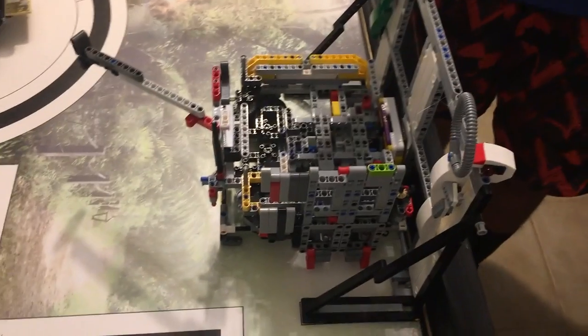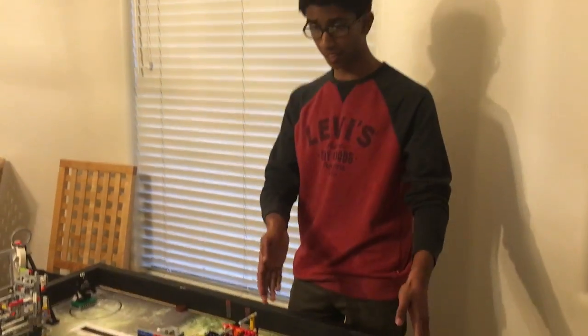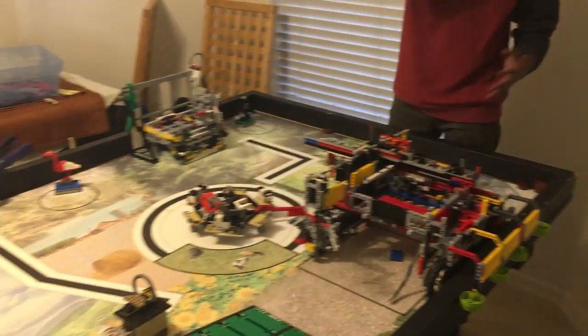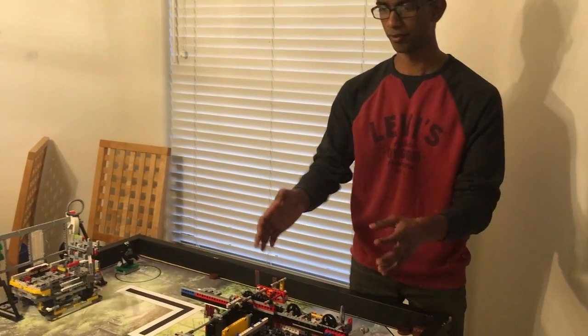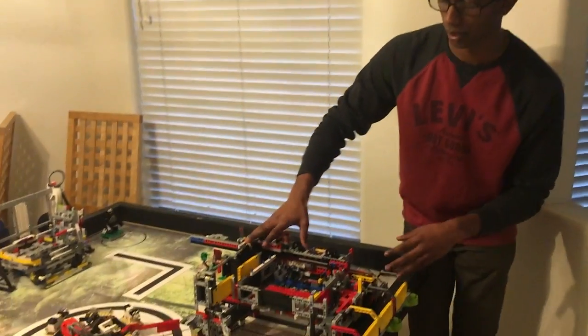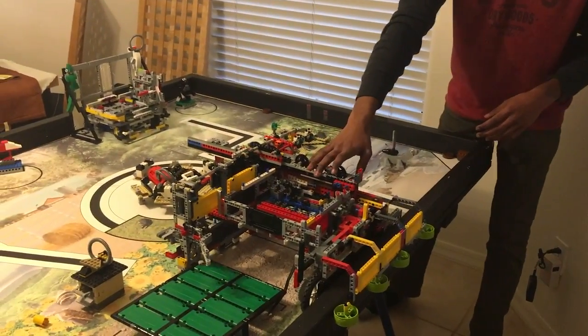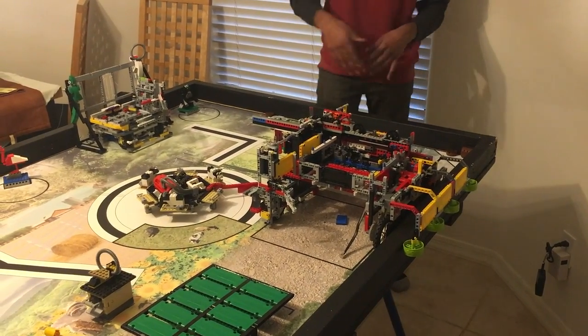When the touch sensor engages, that tells the robot it is time to push up from the attachments and begin to hang on the wall. We've split the board into the south side and the north side — missions one and two run on this chassis along the south side, and mission three goes from south to north, east to west, using the smaller chassis. We limit motion and variables to complete missions more consistently. For this chassis, we run along the x-axis while the linear gear runs along the y-axis.